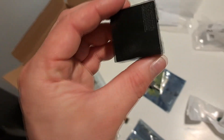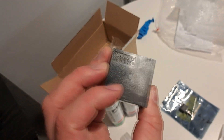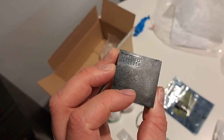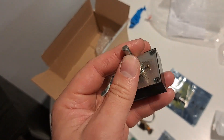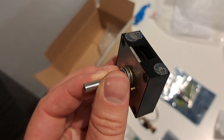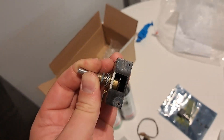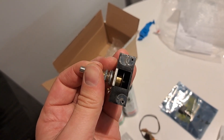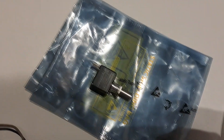This one I got for reference from a gentleman who sold me the radio as a spare part, but this one does not work correctly. That was an original encoder. It seems the blade inside is not that straight, so that's why it does not work correctly. Anyway, I'm gonna change this for the new one.